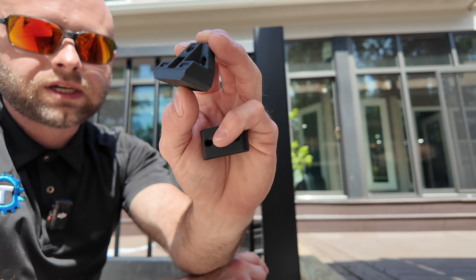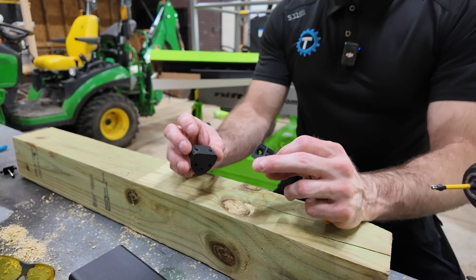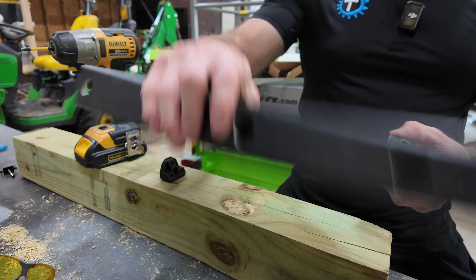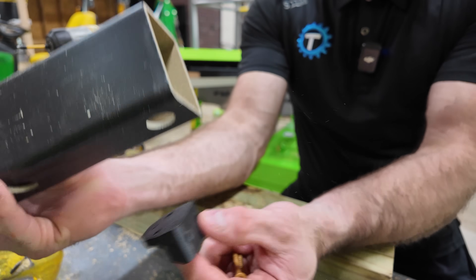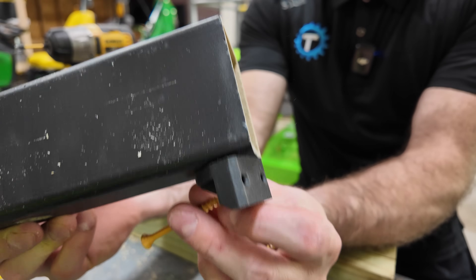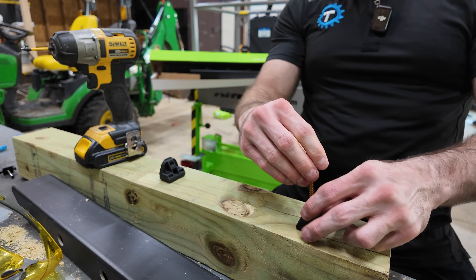I did want to stress test these to see if they're going to be able to take the force. I'm going to do a very simple test — just drill these straight into a piece of wood. This is three wall loops, 25% infill. Probably should have done them at 100% but that was the setting already in the slicer. When the railing is sitting on these brackets, there's no real stress on the bracket itself because the weight of the rail is really on the screw — the bracket is just holding the screw in place. So the material between the screw and where the railing sits is getting compressive strength, not shearing or pulling. I'm not too worried about it.